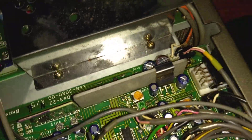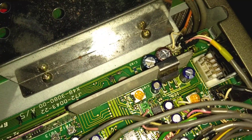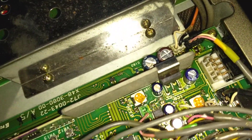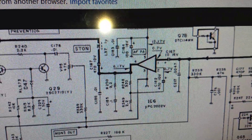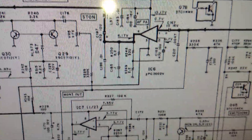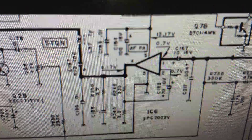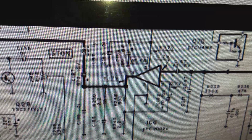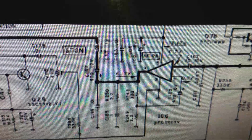I've always told people over the years, if you let a piece of electronics sit, electrolytic caps sometimes will fail, and they fail into a short, from what I've seen. That inductor went out, and if you look at the schematic, you can see right there is L-37, and nothing could put current through that unless C-187 shorted. So that's kind of a given, as far as I can see.